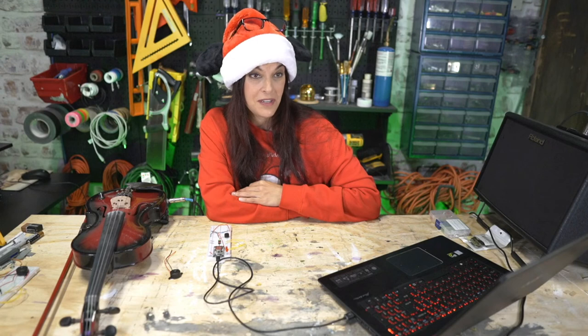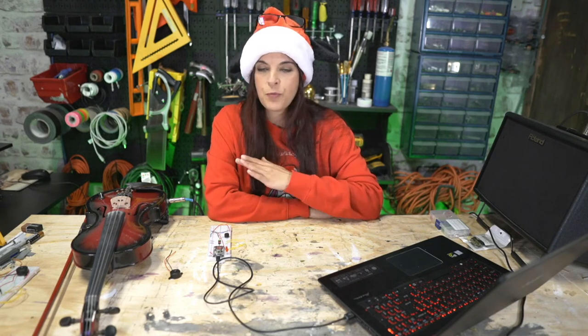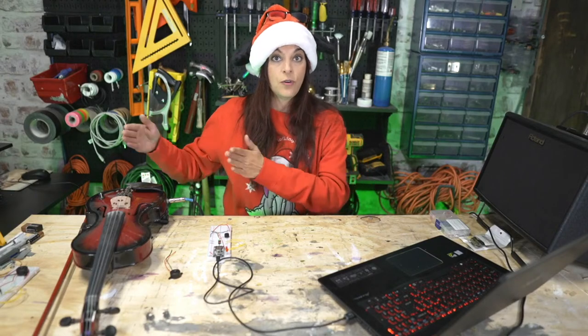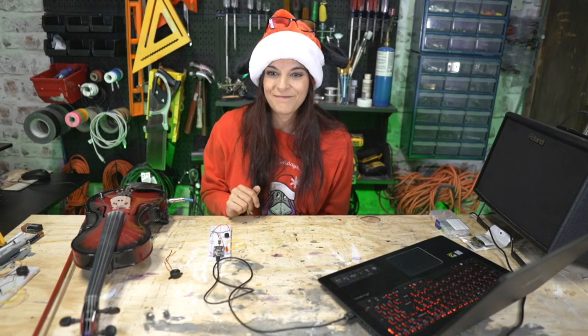Now, say you put way too many notes. What I found that happened was, say Jingle Bells has, I think, 110 notes or something like that. If you put 120, once it finishes the song, it'll pick a random frequency and just beep the rest of the notes at a regular interval until you get to that end number you put. So that end number is not going to affect the rhythm of each individual note. That's basically set by the two code blocks that we did above.